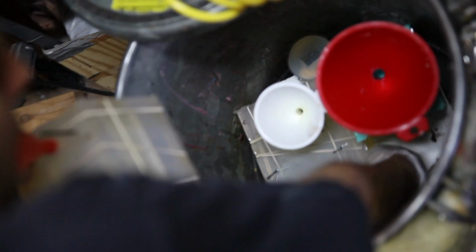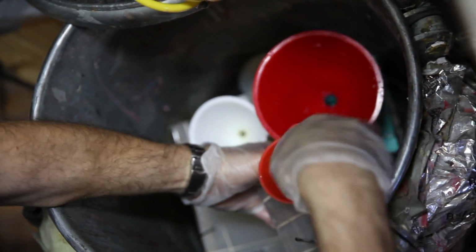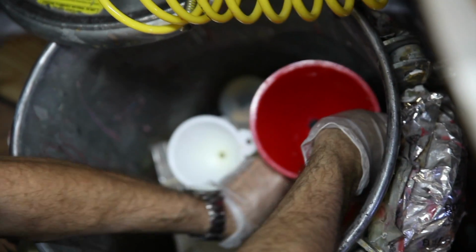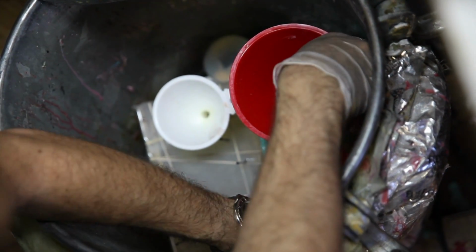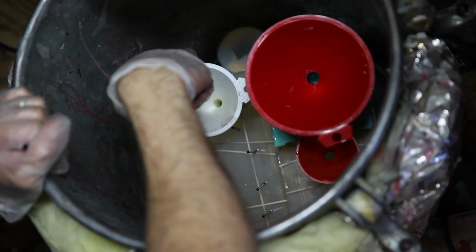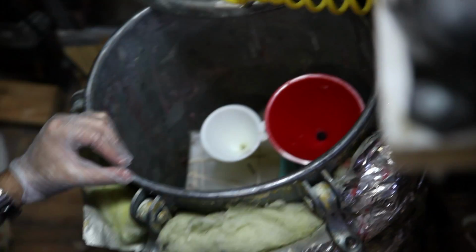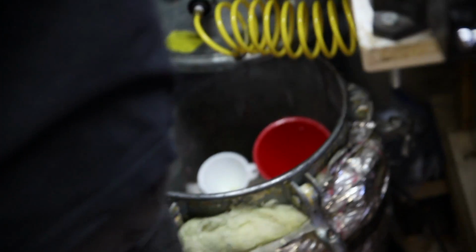So let me make sure, and these are the molds, where I have the bottom slightly slanted. That's so that the material vents easier. This is a tight fit. Okay, so those are going to be my target spots, and I got another little mold in the back there. Those are some stairs that get glued on the inside. So that's the entire dice tower in there.